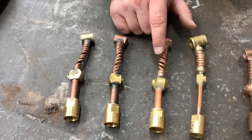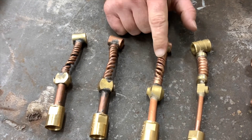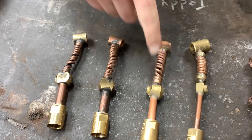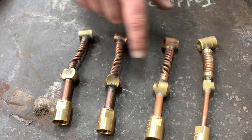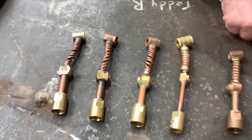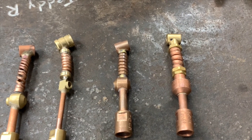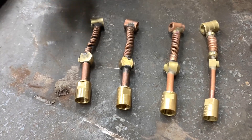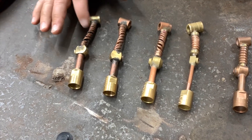From my experience, after you're welding a lot, one of these strands will break. You'll feel your head — when you want to flex it, it'll make a clicking sound, or you'll feel a little clicking in there, and then the neck up here will get super hot. A lot of times it will melt the plastic or the rubber, and then you'll have a torch head failure. The single ones are a little more beefy, and you're not going to have one side give out or have a failure. The double helix ones are obviously thinner — it's still welding, but something doesn't seem right. Well, one of the strands in there is broken.